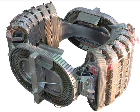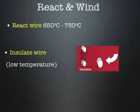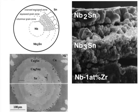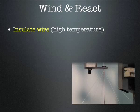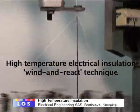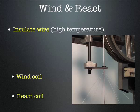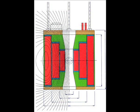There are two distinct approaches for making Niobium-3-Tin magnets. The first is react-and-wind, where one firstly reacts the conductor, then insulates it — usually by continuous coating techniques — and then winds the coil. In the react-and-wind approach, one must wind the coil with the brittle pre-reacted Niobium-3-Tin conductor, which is prone to significant degradation. In the second type, wind-and-react, one firstly insulates the wire with material that will sustain the high-temperature diffusion process. The insulating process can be time-consuming and expensive. One may then wind the coil and react the entire coil package, but the wind-and-react approach may result in large accumulated strain in the ends of the magnet. Magnets with complex end geometries are more prone to degradation due to large local strain.